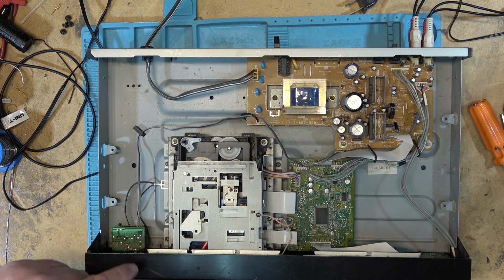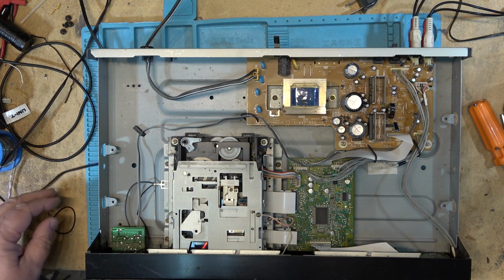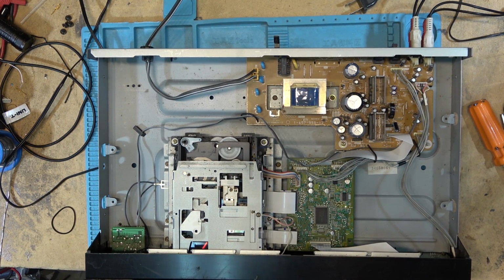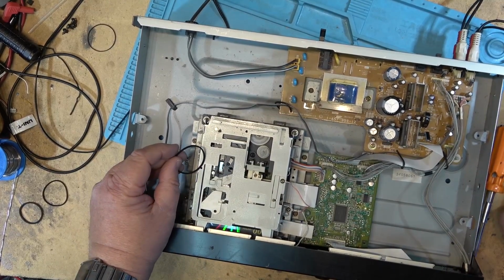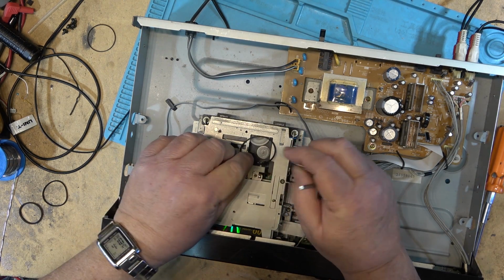So I drag out my mini disc that hasn't been used since I recorded the disc before, only to find out that the belt is shot. So we're changing the belt so that I can get this one recording again, just so I can re-record my test disc. Now, if you're wondering, is that JVC recorder that just trashed my perfectly good disc going to get repaired? Probably not, because the fellow that sent it in was expecting it just to be something simple, and he probably will walk away from it.